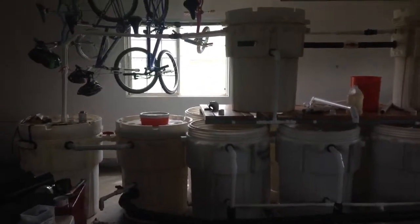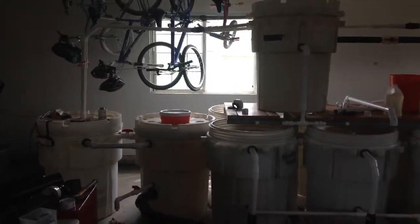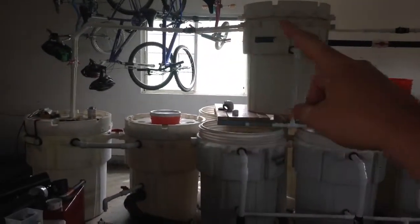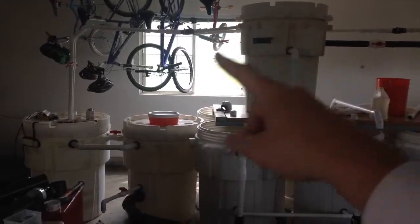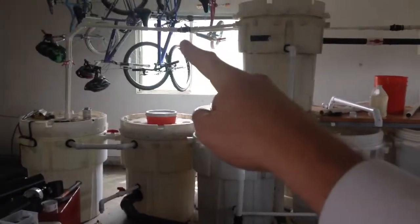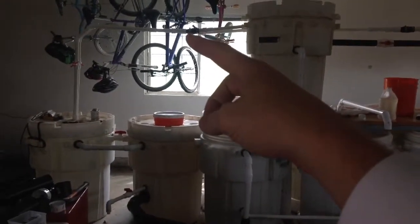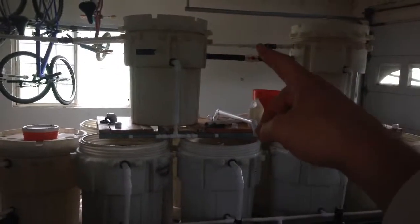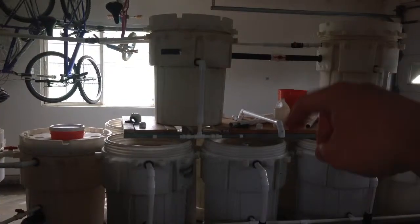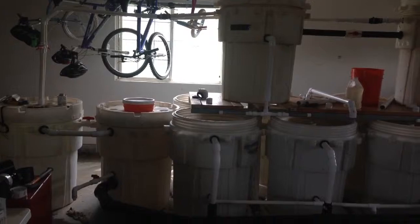Forgive the mess, but let's go over what we've done so far and then I'll start it up and show you it working. Unfortunately, I bought these backflow valves — the water freely flows this way when the pumps are on, but when the pumps are off in the sump tank, these backflow prevention valves here — for some reason there's a hole drilled in each one of these. I've turned it on and it's shooting water like crazy, so I've got to do some sort of fix on that. But I'll show you in a second when it's working.